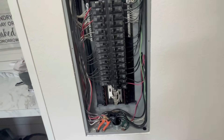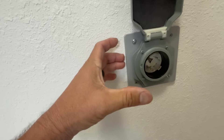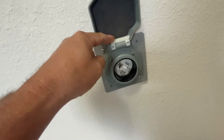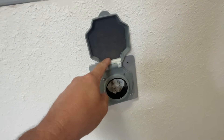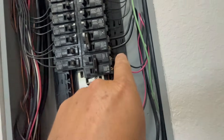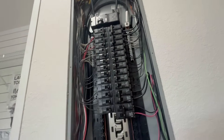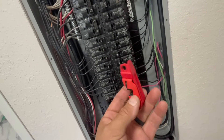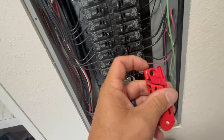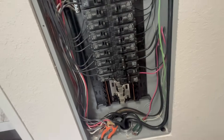I'll link to this outlet — it's about 40 bucks. I used a four-inch cut-in box and jury-rigged it so it's set inside the wall. We've got 10-gauge wire — two hots, ground, and neutral — with the two hots landing on the breaker, the neutral connecting to the neutral bar, and the ground to the ground bar. I'll also link to this lockout breaker switch on Amazon — you fold a little piece over and put a lock through it so nobody can accidentally turn that breaker on.